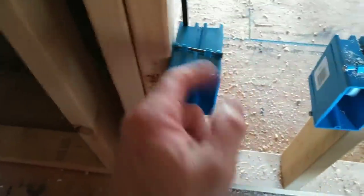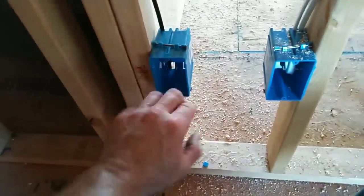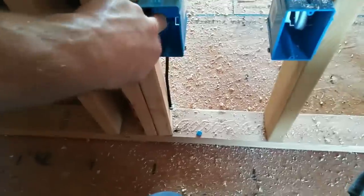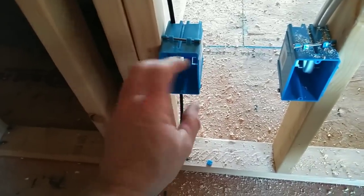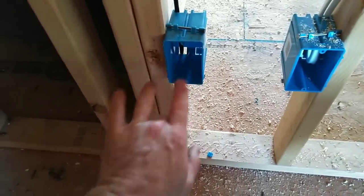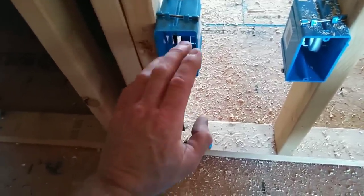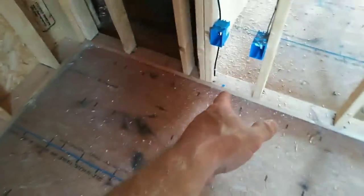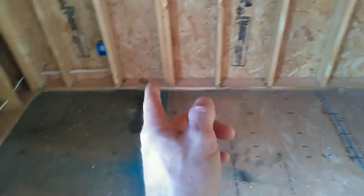In this particular case it's an RG6 low-voltage cable so it doesn't really matter. After sheetrock goes up I'll reach my hand in here, grab this wire — you can see it moving at the bottom — pull it out, do my connections with the cover plate, coil that wire in a circle, and insert it into the box. I leave as much wire in there as possible. Pay attention not to break your wire-holding devices out.